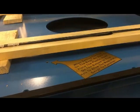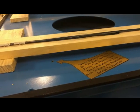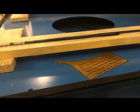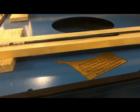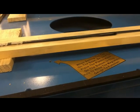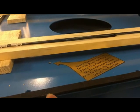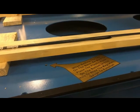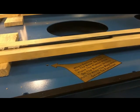Of your filter unit, just take a pair of side cutters or a knife and just reach up in there and cut that hose off to where you have about 2 or 3 inches sticking through the inside of the filter unit, and it will sit beside the outside of the filter. That goes into the Magnehelic gauge, which reads the filter condition. But that hose, all it does is read the pressure differential between the inside and the outside. And this is the only hose that you have to put in, just this one hose. And you'll see it sticking down out of the bottom of the motor/fan unit.